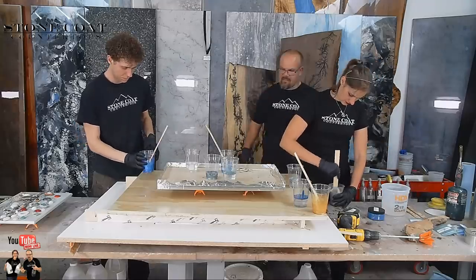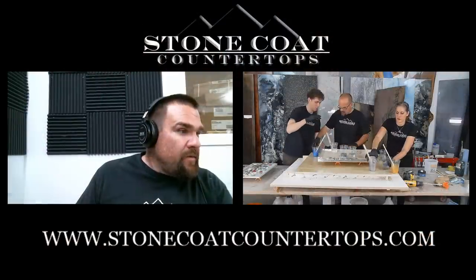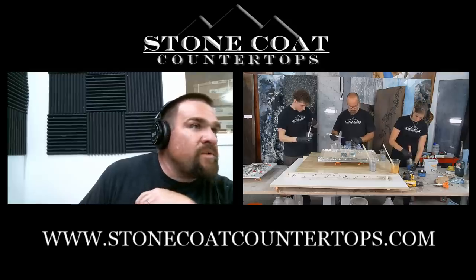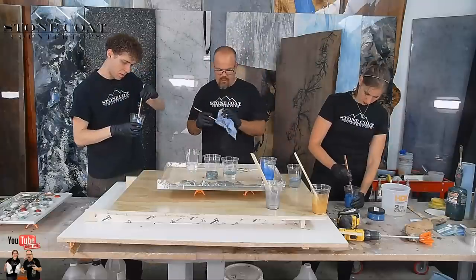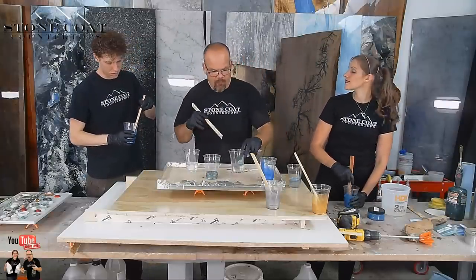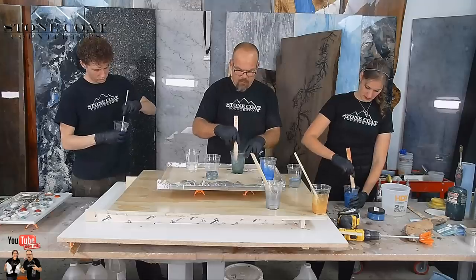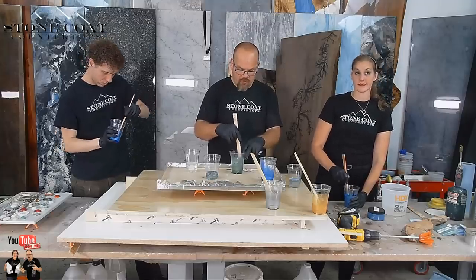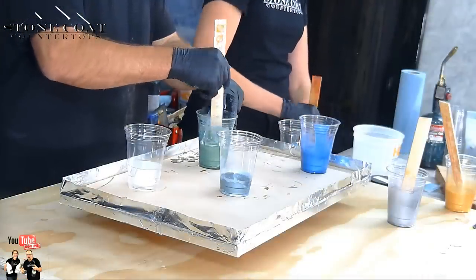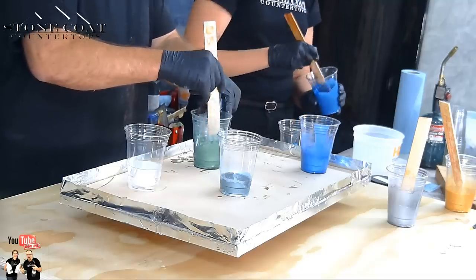All right. I'm going to save that clear over there because we may have another project. I got a question here. J.R. McClure asks, can this product be used over marble 12 by 12 tiles? Yeah, you're going to want to use a clear bonding primer over those tiles, or a bonding primer if you're going to go opaque and really hide the tile. If you're just making decorative tiles, there's not a lot of prep involved. But if you're going over a floor, there's a lot of prep involved. You've got to fill in all those grout joints. So ask him, is he going over a floor or just making one piece? A lot of people will use a tile almost as a canvas. I'll wait for an answer.